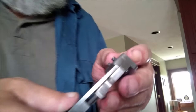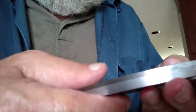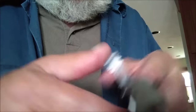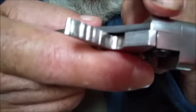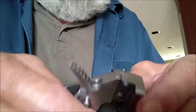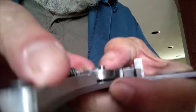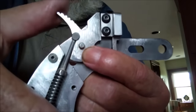Since the last time, I was kind of worried about the 8-32 threads in just a single layer of that eighth-inch sheet metal. So I JB welded another piece of eighth-inch on there, then drilled and tapped through it also. Now it's got twice as many threads. It just made me feel better about the whole deal — I don't know if it was necessary or not, but I did it because I can and I wanted to.